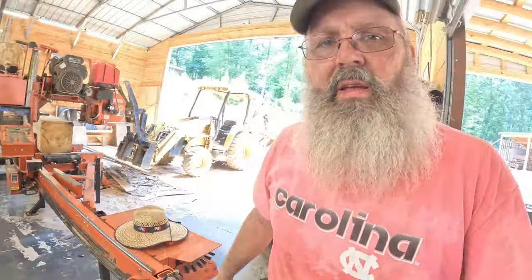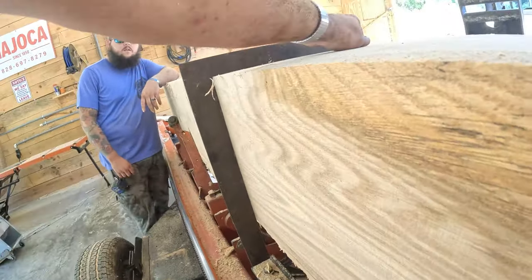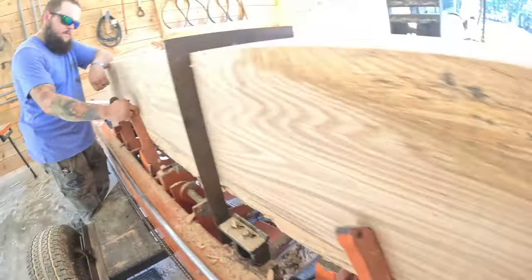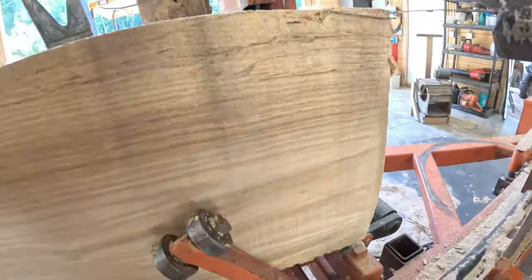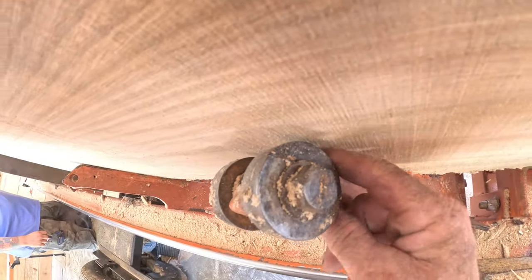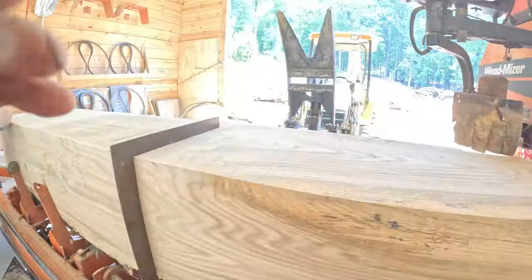You gotta fix it. I threw the framing square on the cut after I made it to do two things. To verify that our cut is square, and then to verify against these uprights as to how they're setting. This one's close. That first one is way out. Yeah, the first one could probably use just a little adjustment right there. We'll have to do it with a smaller piece of wood on there, but yeah. We get down to a 6-inch wide piece and get it done.